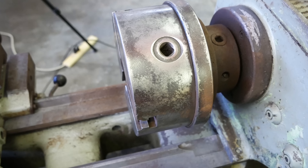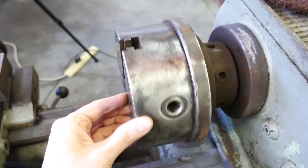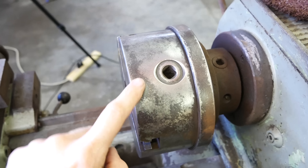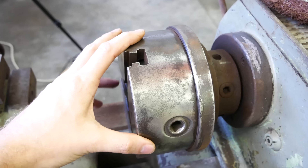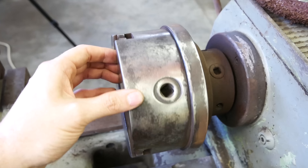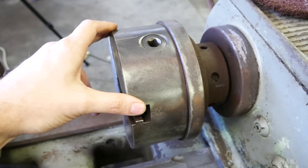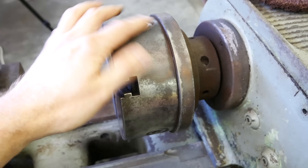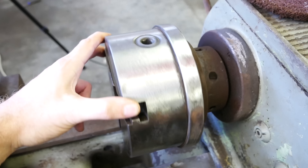Let's see how we did with the spindle. This side was the light-duty scotch-brite pad — it blew through the rust pretty quickly, but it didn't take care of some of the discoloration. That's not necessarily a bad thing; it might just be mill scale. One nice thing is it's pretty gentle on the surface itself — doesn't do much scratching. Next up, the wire wheel — probably even a little more gentle, but took a bit more effort. Still pretty effective at removing rust though.